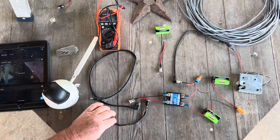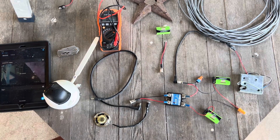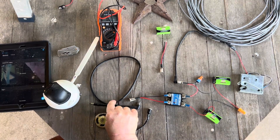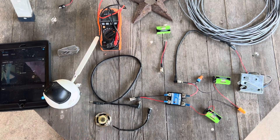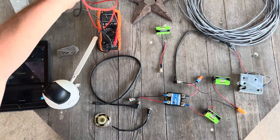This camera's already been modified. The speaker here I just buy off Amazon — that's an 8 ohm half watt speaker. I've just got a DC jack wired to it. The little short cable I have here is what you're going to have something similar going from your camera to your gate box — it's just a shortened version so we can test our cable first.